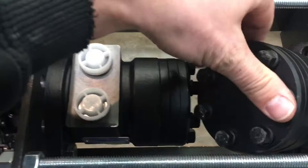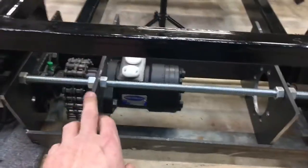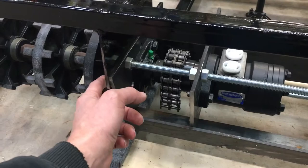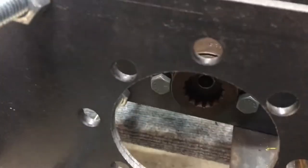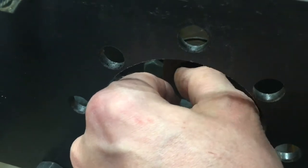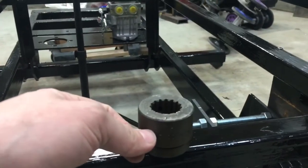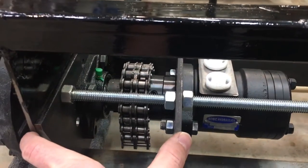I think I might have a solution. What I need to do is move these two inner plates just a little bit closer to the flange bearing. The spline on this track drive shaft — there's about three eighths of an inch that isn't engaged onto the splines at all. So what I can do is machine off about three eighths of an inch from this hub. We're not going to lose any structure there, and that will allow me to move this plate about three eighths of an inch closer.